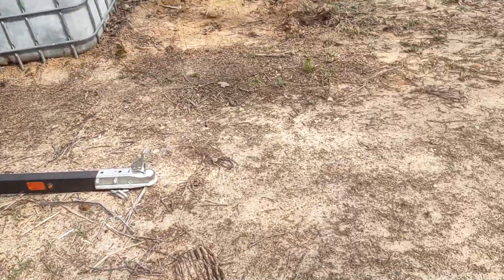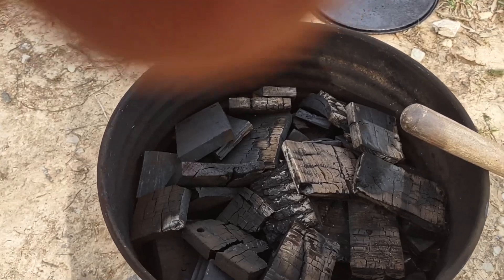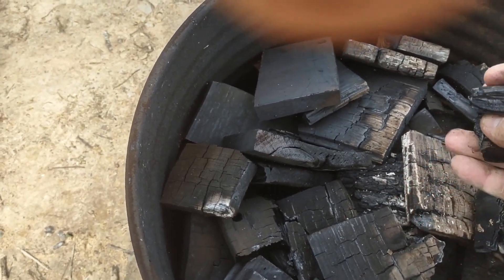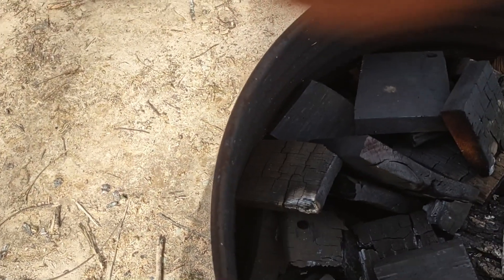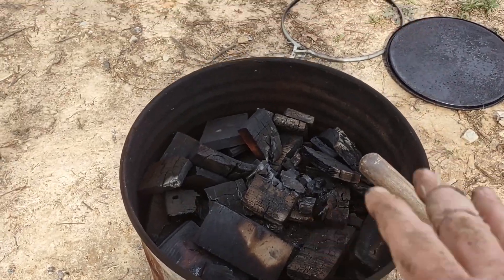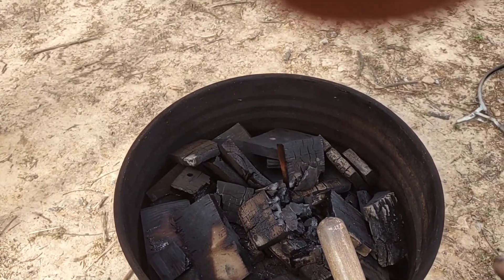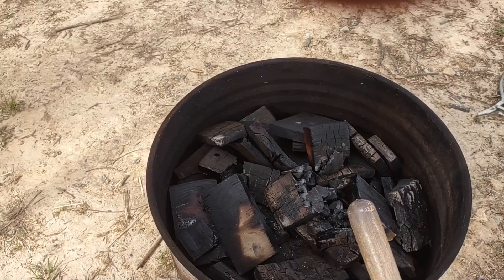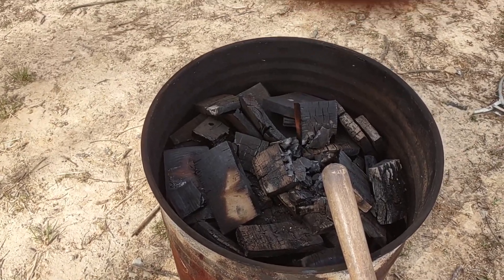When I put this shed up I used fence pickets as the walls, and had about six inches of tops left over — those go in too. Some pieces are unburned, and you can see different levels of char. I started the fire at the bottom, and once I had a clean flame with no smoke I'd let it burn, then add a few more pieces. The key is not adding so many that it starts smoking again.